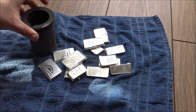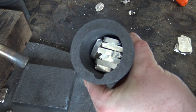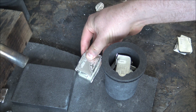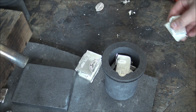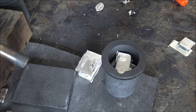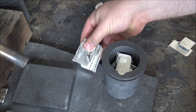Hopefully we can get 35 rough ounces into this graphite crucible and the next step is getting it all melted. Having played a little bit of silver tetris with this graphite crucible, we've got the majority of the shipwreck silver in there. We've got three bits left over which haven't quite fit in yet - that's not a problem, we can drop these in when the rest of the silver has melted down. Two little bits will be saved for another time to create a smaller shipwreck silver bar. Today it's all about achieving a kilo plus - 32.15 ounces is the minimum, which is why we've got 35 ounces in here to guarantee we're going to be over that kilo number. It's not about hitting exactly a kilo - it's about getting a nice looking bar that is over a kilo. And then of course the moment of truth: pouring the first ever Backyard Bullion shipwreck silver kilo plus bar.